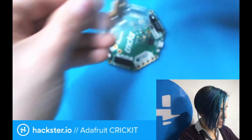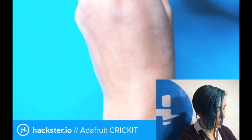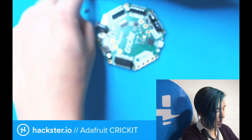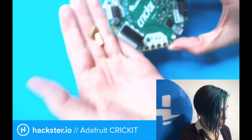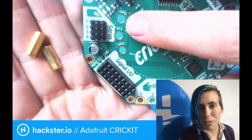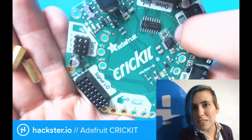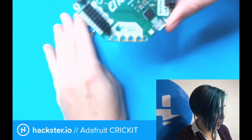It's got all this stuff on it because these are standoffs to mount the Circuit Playground Express on top of the CRICKIT so that you can easily have these little electronic connections as well as structural support. These are labeled ground, SCL, SDA, NeoPixels, speaker, and Vout inside the little outline for the Circuit Playground Express. That's where it gets mounted.